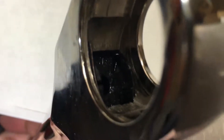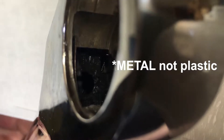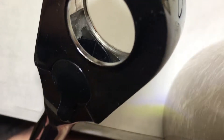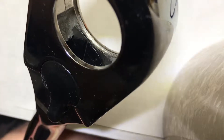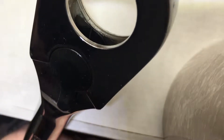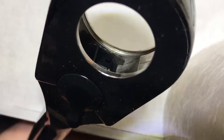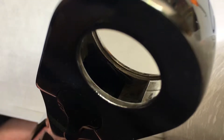I can't point and hold the light at the same time, but on the very left side toward the edge of the head there's a thin strip of plastic holding a detent. On the 2018 model there are two ball bearings in holes that act as the detents for left and right direction change, giving you a spring action when you switch direction. I believe that piece of metal is now the faceplate for the ball bearing detent. I tried to get it out but it doesn't easily slide out, so I left it alone.